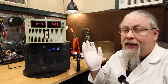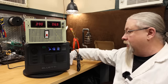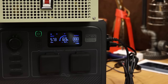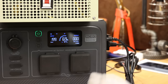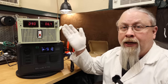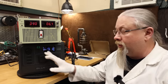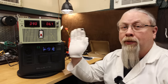What about simultaneous charging — can you charge from AC and DC at the same time? With solar pumping in maximum 200 watts, plugging into the wall brings the total input up to 600 watts. Unplugging from wall power immediately drops it back down to 200 watts. It allows simultaneous charge but it doesn't make it charge any faster — it prioritizes solar first, taking 200 from solar and 400 from the wall for a total of 600 watts.